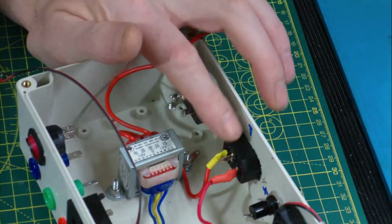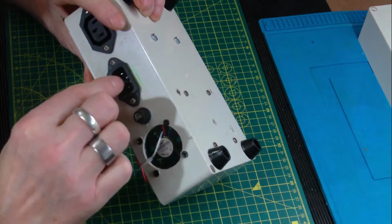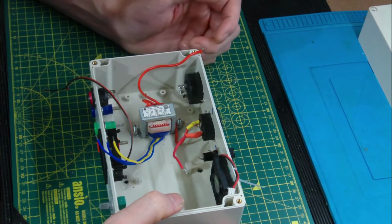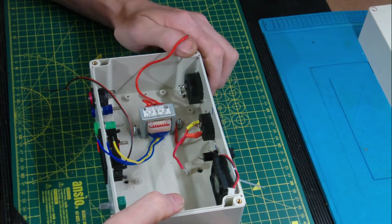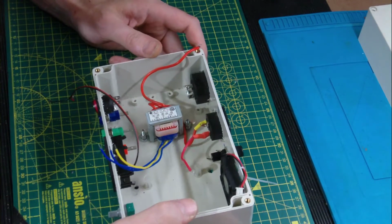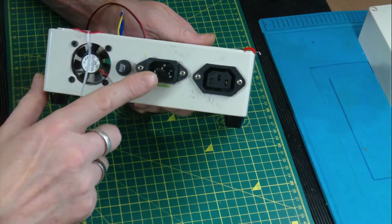these IEC connectors from China, just a bit of a warning guys, let me zoom you out here. For all intents and purposes they're fine, not a problem. The connections seem quite strong, easy to fit. Problem is I have found on numerous occasions if you solder and your dwell time on the actual solder joint is too long, they do work themselves loose. If you're going to use IEC connectors on something that you're going to value, then please buy some decent ones. Don't buy the China ones. Just my preference. With such a large wedge of metal on the end, the amount of heat you have to apply to make the solder flow is very, very detrimental to the actual unit itself.